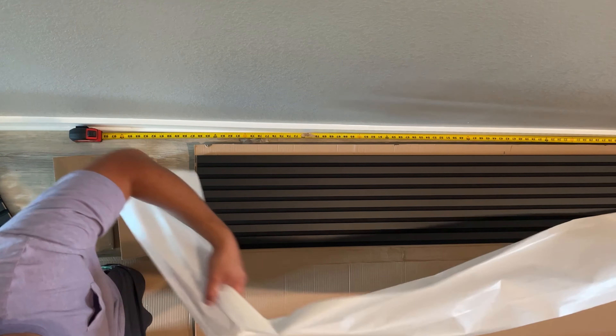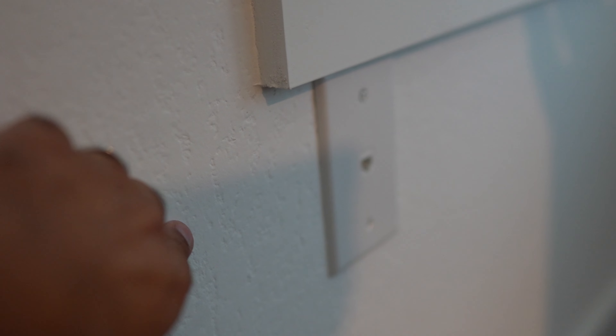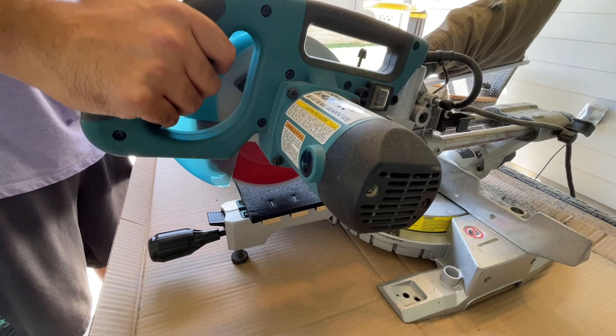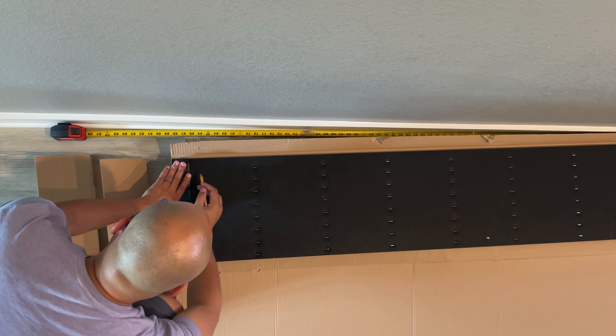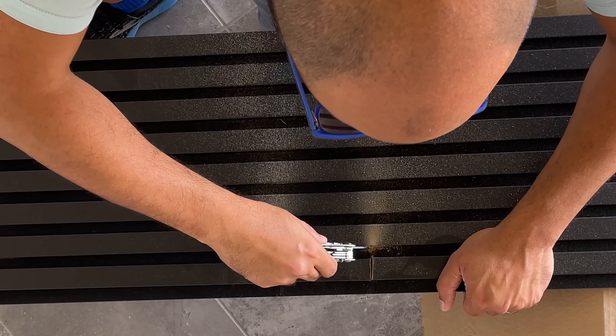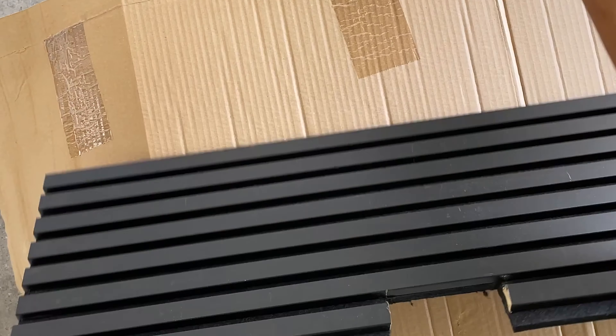I'm not sure what day renovation this is. I got the rest of the panels in the mail. Before putting them up, I was thinking if I want to get cat six cable from my computer station to the closet, I'm going to need to run it somehow — and I think we're going to run it behind these wood veneer panels. A couple of things I've learned: if you don't own a miter saw, it's actually pretty cheap to rent one from the hardware store. After cutting the first panel, I'd use the leftover scrap as a guide for measurements. This Dremel tool really helped with cutting notches, and buying a staple gun to work with the loose wood ends instead of super glue was so much easier.